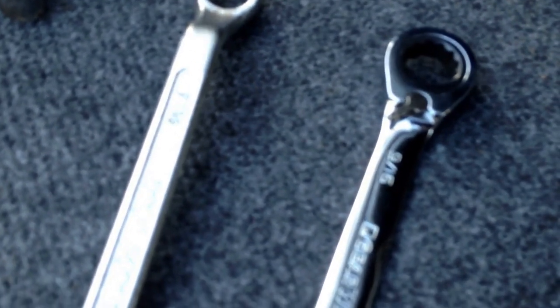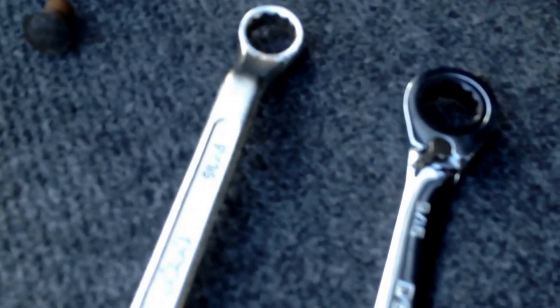I put a washer on each side. You can see under here — I've got a washer on that side, and then the nylock nut goes on. The nylon part faces out, so it's the last thing to screw on. It takes two 9/16ths wrenches to tighten these 3/8ths inch bolts. I use my favorite gear wrench ratcheting one on one side and then just a box end on the other side.